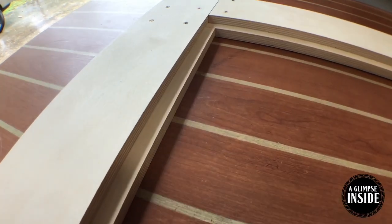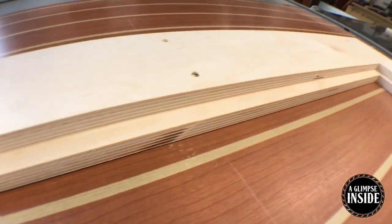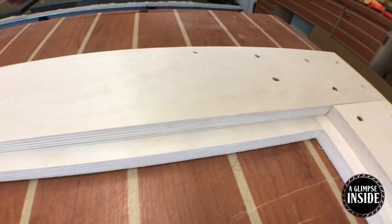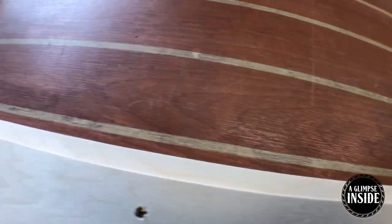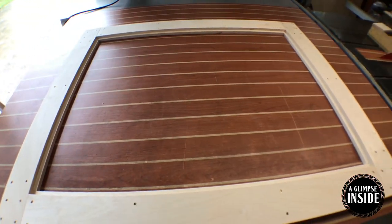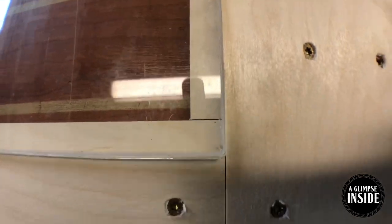It looks like we have a tight fit — check that out. Here's a quick overview: you can see the three and a half inch pieces are layered to give you a rabbet where the picture rests. The half-lap joints at each 90 degree angle give you a super strong and unique frame constructed with very minimal tools and no miters. Miters can be an absolute pain, but this avoids them entirely.